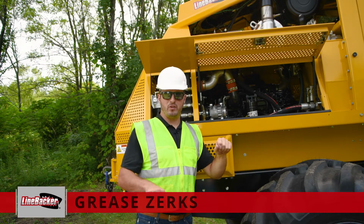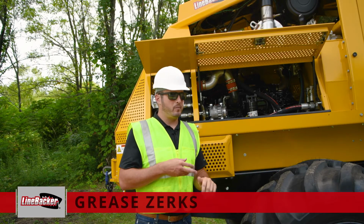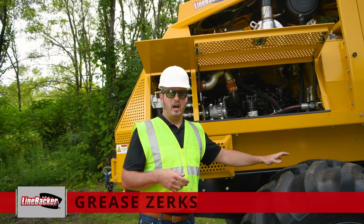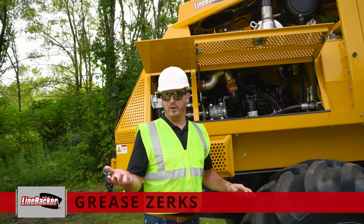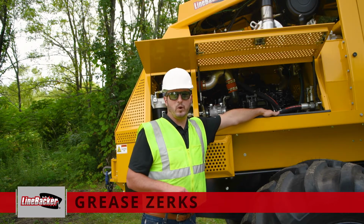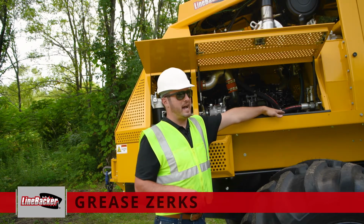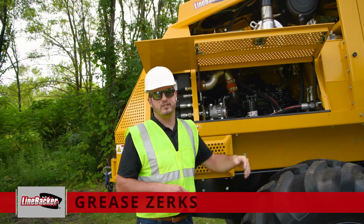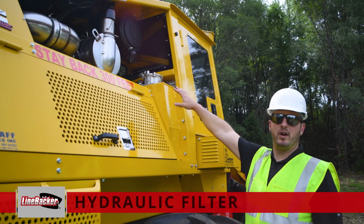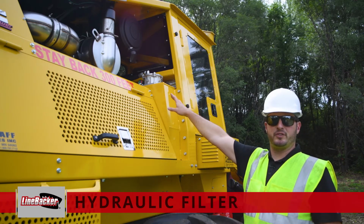So this rear axle actually oscillates. The front axle is fixed. And there's 2 grease points underneath the machine, so you don't have to crawl under there to grease the machine. We brought those remote grease points up to the top here, so you have nice, easy access to these 4 grease zerks here.